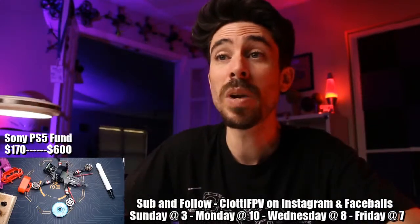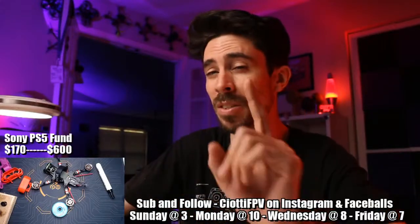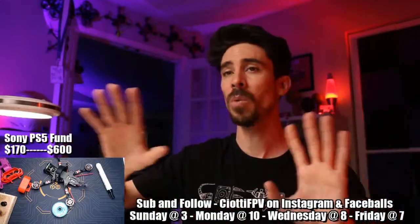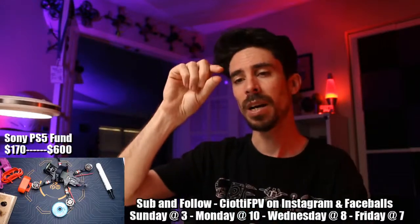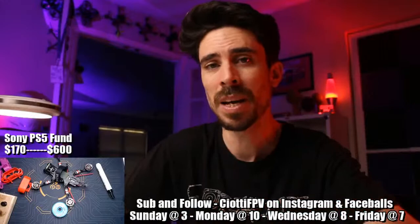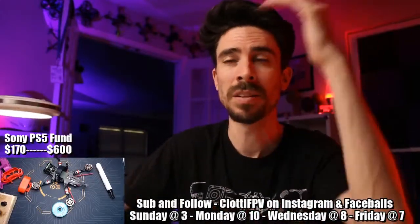Espander says, Micro Apex has 28mm standoffs in the front, 20mm in the back. That means that it should clear the run cam hybrid. Can't guarantee it because it's close. 28mm standoffs, it ends up just the right size. 30mm standoffs, good to go no matter what. 28mm standoffs, it is tight. So it's going to depend on where they put the mounting holes. Hopefully there's a set of mounting holes. Like I said, just look up Micro Apex on Rotor Builds and see if anybody has a run cam hybrid in there. Perfect. Mr. Huggy says Impulse RC actually shows it with a run cam hybrid. Done. There we go.